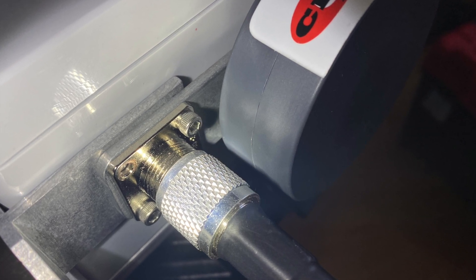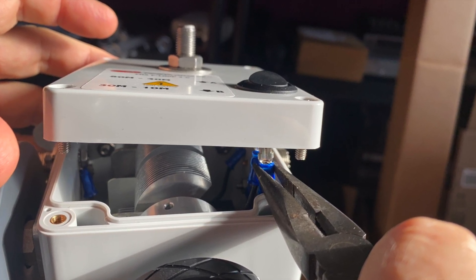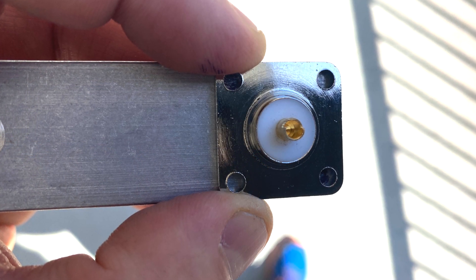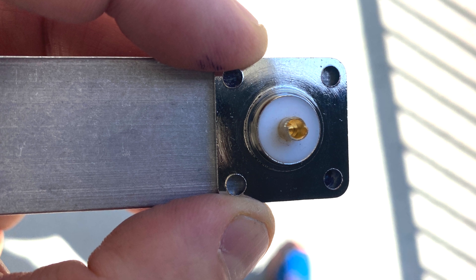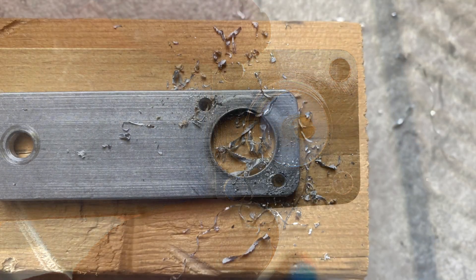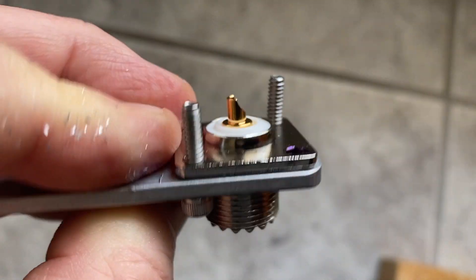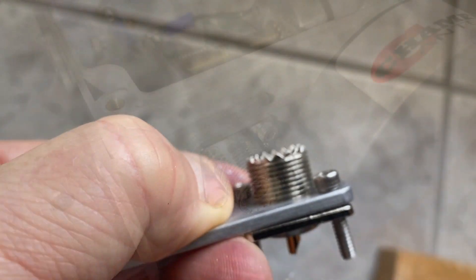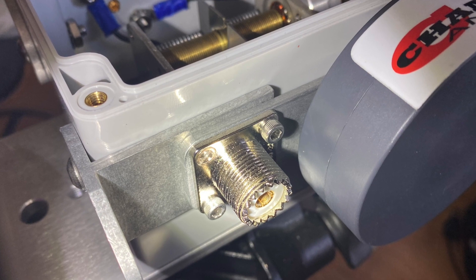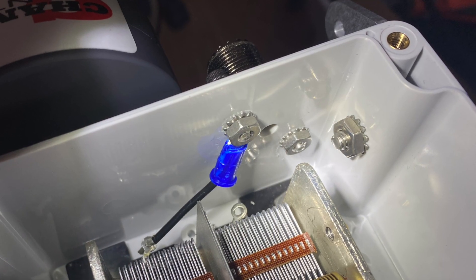I have tried different methods and this one is the one I ended up with. I opened the box — as a note, gently pull the two cables for the switch with a pair of pliers. I took out one of the SO239 connectors and used it as a template. Use a sharpie to mark the two holes on the compensator arm, then drill the arm — which is aluminum, so it was quite easy. Ensure it fits and is aligned properly. Then I inserted the compensator arm in between the SO239 and the box, screwed it back in place, and noticed that the screws were just long enough to accomplish this modification.